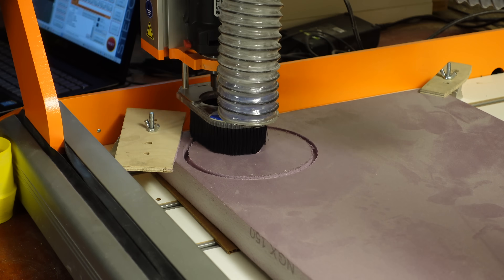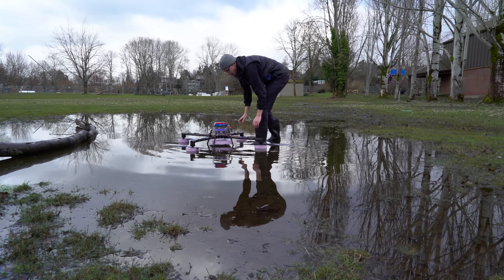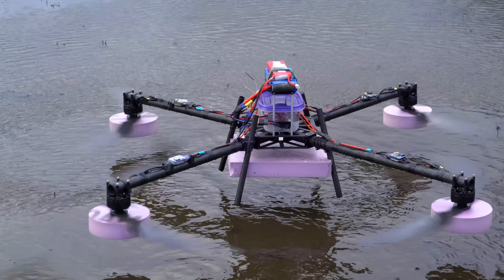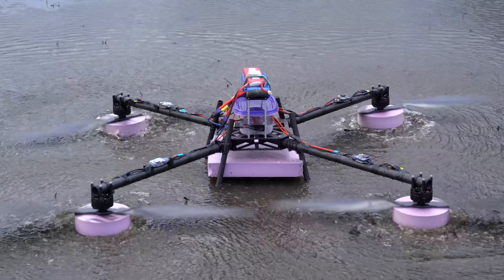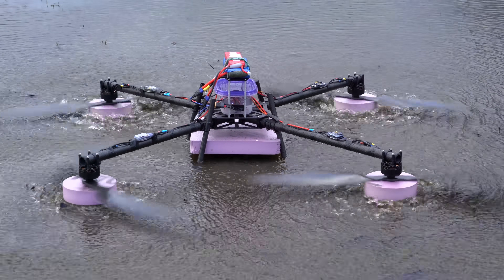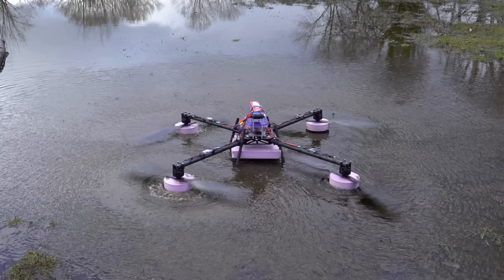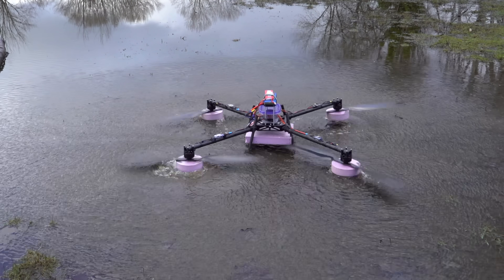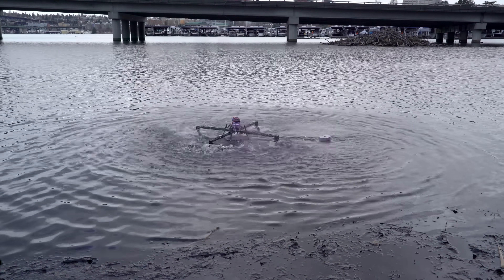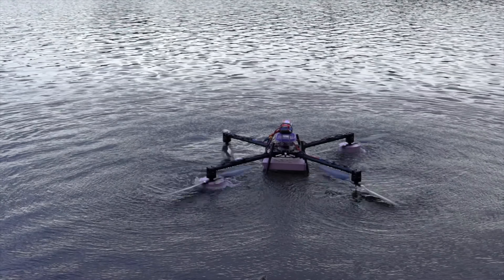The big props may be less efficient, but they are cool, so let's try them out over water. I CNC cut some foam donuts that the aircraft would hopefully float on as landing gear. This ended up sort of working, but ultimately they didn't have enough buoyancy. It was pretty cool being able to hover with the props just an inch or two above the surface. Every now and then a prop would strike the water and slow down, but as a whole the aircraft was pretty resistant to this — it would usually just keep flying. It was amazing how slow these props could spin and still keep the aircraft airborne, which was extra apparent near the surface due to how strong the ground effect was. I was kind of hoping the ground effect would be even stronger when the props were practically skimming the surface — kind of like a force field preventing them from ever touching the water. This didn't end up being the case. Right next to the water, the props just kind of start swirling the air around in circles rather than pushing it down.